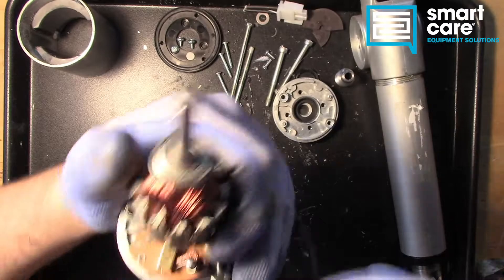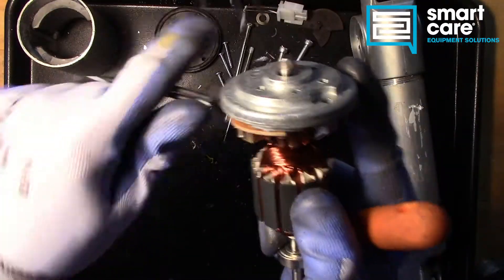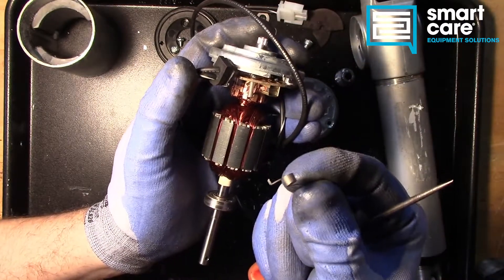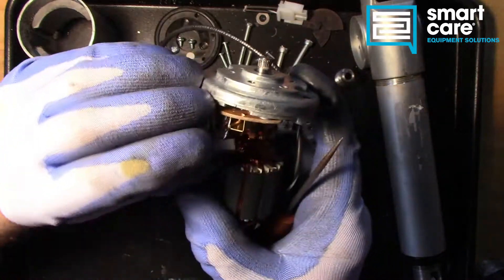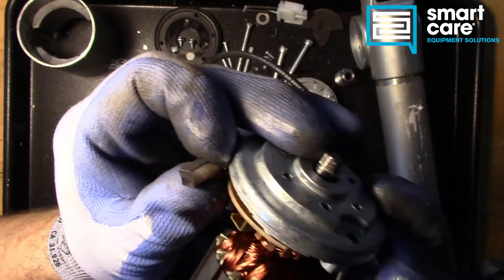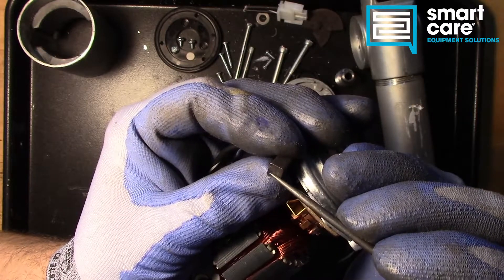Let's pop apart one of these brush springs. Once we get the brush spring out, we should be able to take the brush itself out of its retainer. You can see that spring is pushing on the back of the brush — and then we release it, spring comes off. Now we can work the brush up and out of the retainer. You can see the material the brush is made out of and how it's worn to fit precisely against that comm surface. It's got an arc to it where it fits firmly up against — the tighter the fit, the better it will make contact. And you can see from this one it has not been in service very long, because it still has the manufacturing marks across most of the brush. It's really only worn in one little corner.